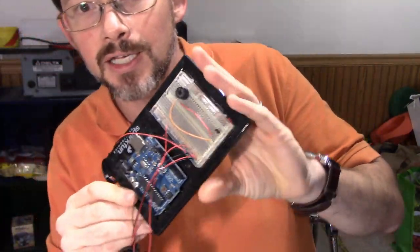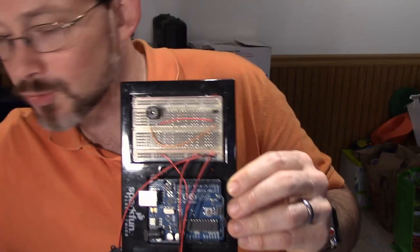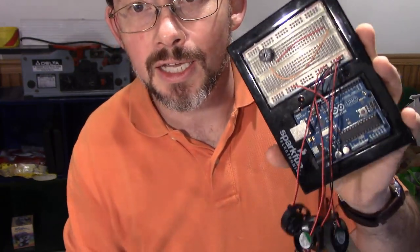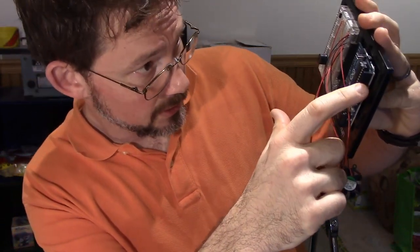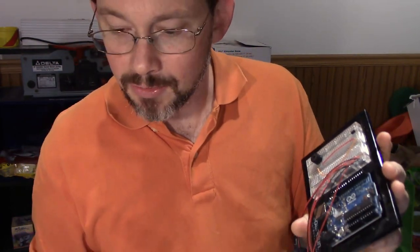And so one of the things I was going to show you is that the best way to get started with any kind of electronics project is to get a little breadboard like this, maybe get an Arduino, and if you get a kit, like I got this kit which is the SparkFun electronics kit, it's really nice because it has a whole bunch of projects, a great way to get started. And so with any project like these light strips that I'm going to be building today, if you can get started by prototyping it out, you've got a dedicated plus on the board, 5 volts, and you've got a ground, and so without even fiddling around with anything, you can plug in an LED to the boards here, and then you can plug in a resistor, because you always got to have resistors with your LEDs, right? So you can do that, and you can light up an LED, and then you're going to get pretty darn close to the boards that I'm going to be reflow soldering today.